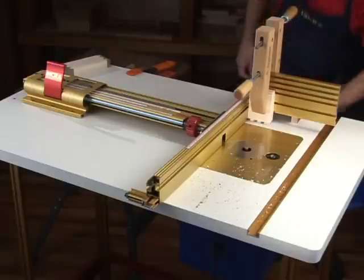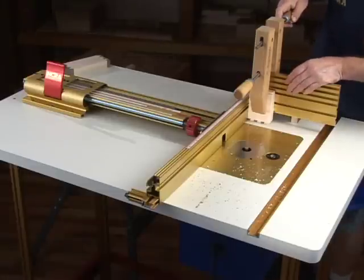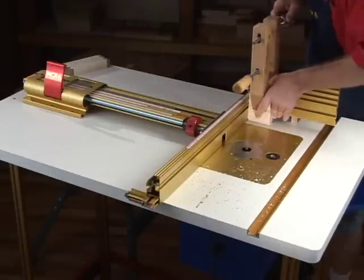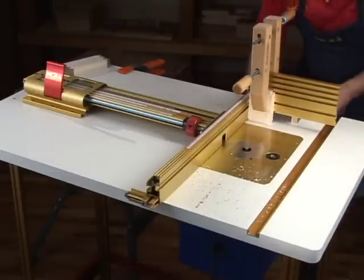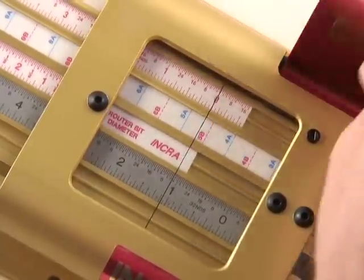After completing the cuts, immobilize the right angle fixture by clamping to the fence and to your table, then flip the stock. Return the LS to a scoring pass and repeat the final tail series of cuts on your two boards.